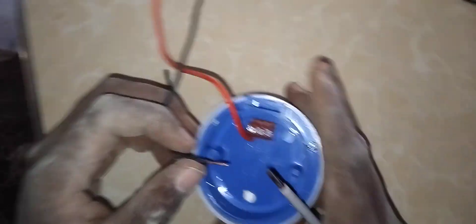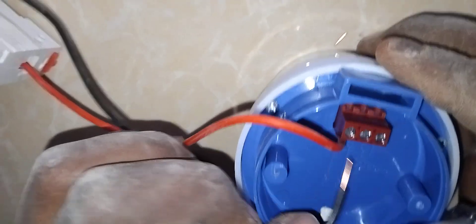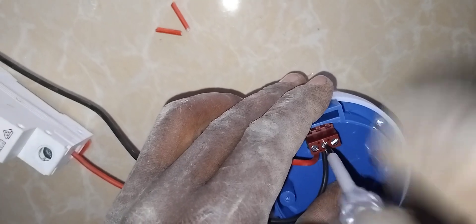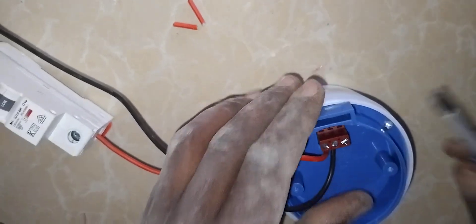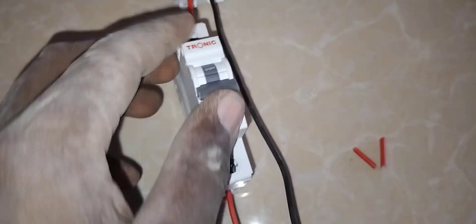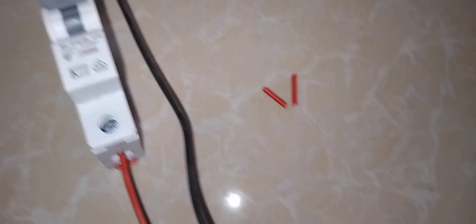Make sure the photocell gets light. You pick your neutral to this side, this part, and enter it here. I think you are seeing — the neutral. The main comes from that socket, it has entered to this double pole, and the live wire is made safe through the MCB at 10 amperes.